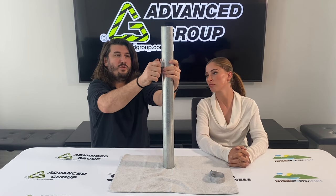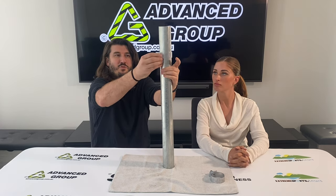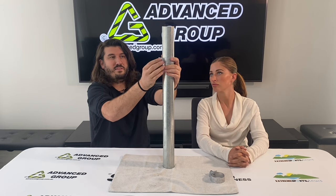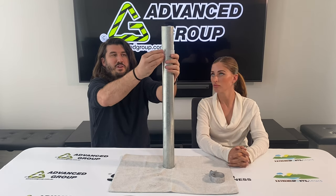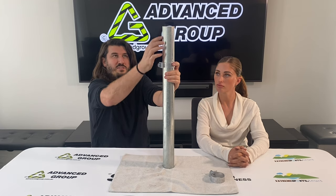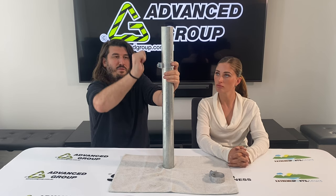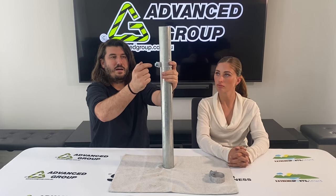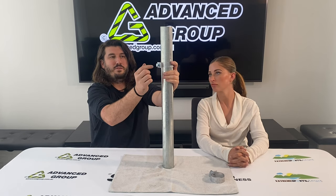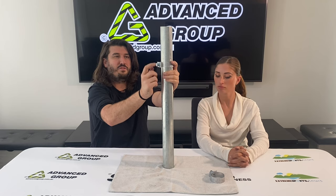Not enough to notice from a distance if you remove this. However, if you were to investigate the pipe, if it's been in existence for a while and had multiple signs moved, relocated, added, removed, or adjusted heights, you might notice some tiny little indentations up and down the pipe in various locations — and that's just from this bolt being tensioned. The perfect tension will be when it pretty much stops if you're doing it by hand, and that will mean it's tight on the side so the sign won't flop and flap around in the wind and make a noise. The indentation will just be that perfect amount so that you're not over-tensioning and snapping the bolt head off.